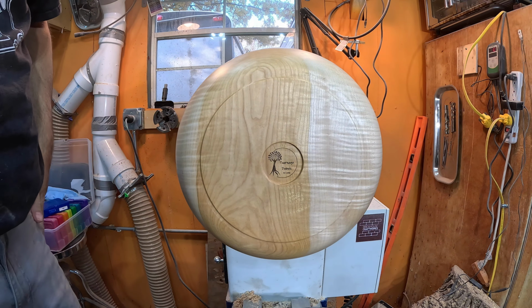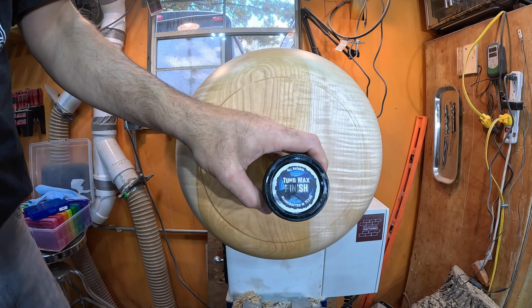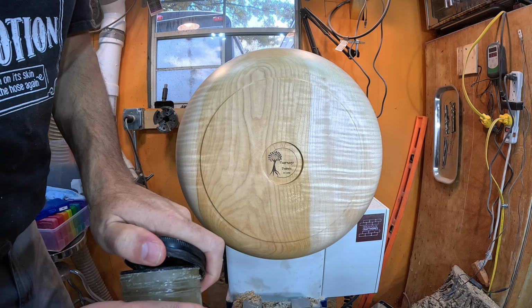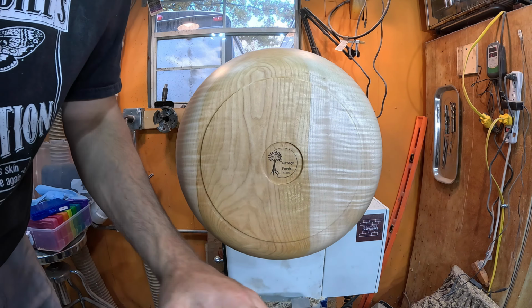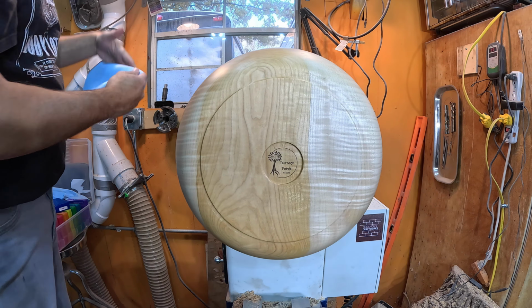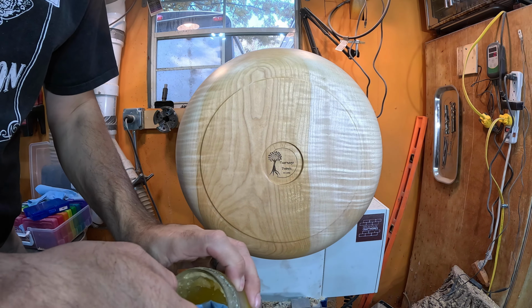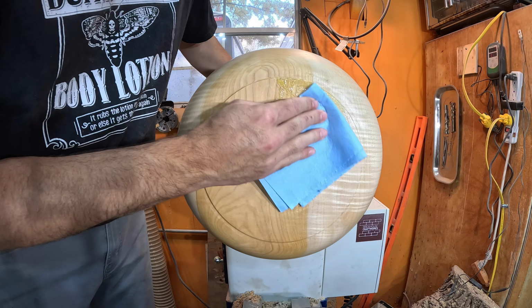All right, we have that laser engraved. So now we're going to use our Tung wax finish from Brad's. And this you put on, well, you can do it any way you want, really. What I typically do is I will put it on relatively liberally, and then I will let it set for at least 15 minutes, and then I will come back and buff that off